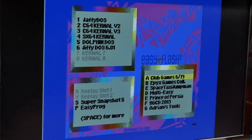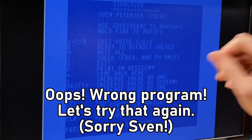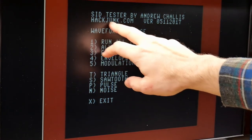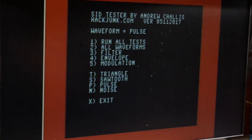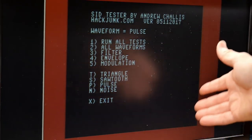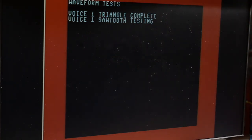If we reset the machine and I go to Adrian's tools, I have the SID analyzer here, and let's run that. This should be a very comprehensive, oh no. I have on here the SID tester, which is a relatively comprehensive test suite made by Andrew Challis, hackjunk.com. I'll put a link to this program in the description below, but let's run all tests here. And this just goes through all the possible waveforms that SID can make. And if anything is out of the ordinary, like one channel is burned out or partially failed, that just gives us a good idea of how things go. Let me turn the volume back up.